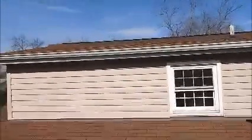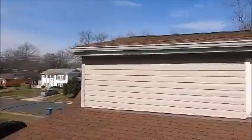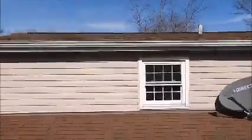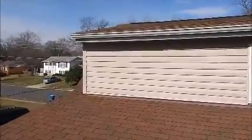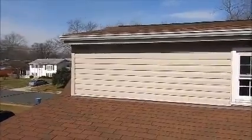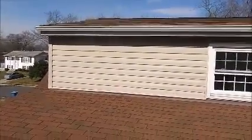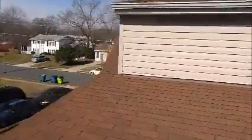because what's happening is when it rains really heavy, that water is ponding in that area because the water cannot go uphill quick enough to where the drain is. So when the water reaches the height of the screws that's holding the gutter into place, the water will seep right through the sides of the screws, through the fascia, and down behind the siding, and again, settle on the lower roof. But here's another thing.